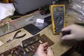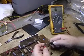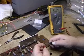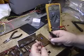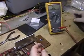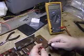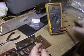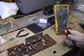Here's a 15k resistor — it reads 19.95k, and the most it should have read was about 16.5k. Here's a 22k resistor involved with the first operating stage, reading 27k. Most of these things will just give you a hard time, and quite frankly the board will not operate properly.